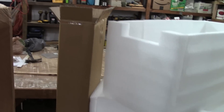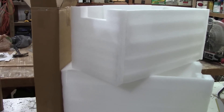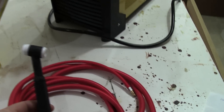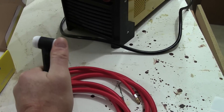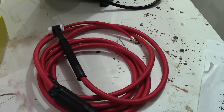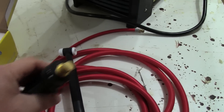On the end of the box is the accessories box. Previously people were complaining everything was loosely thrown in, but it's a little better packed now. First, there's an upgrade to the torch — a WP-17 flex with a flex head, so there's a little movement on it. It's not quite like a CK super flex hose, but the hose is an improvement over the earlier versions. The lead is 12 feet long.